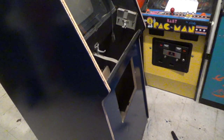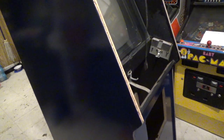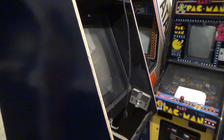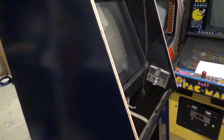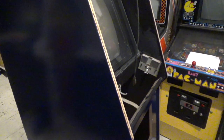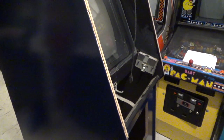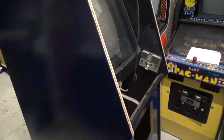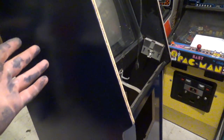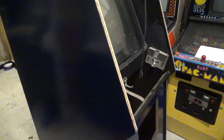Well guys, it's painted. I thought I better mention OneCircuit — it's a YouTube channel, check it out. And if you don't know anything about John's Arcade and you're watching me, check out John's Arcade — he's got a million videos. Some of you might wonder why I did not use primer. I'm planning on making multiple coats, and this whole first coat is going to be sanded. The reason you want primer on wood is so the paint doesn't absorb into the wood, but I don't mind if the paint absorbs into the wood at this point. This is not going to be a one-coat-and-you're-finished ordeal — it might be three or four coats by the time it's done. So I'm not worried about primer. This first coat is not the best looking, but once I sand it, it'll be just fine.